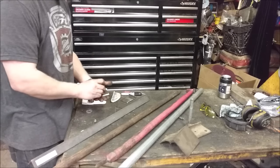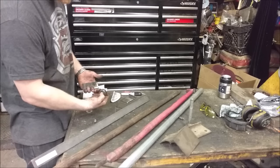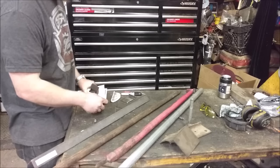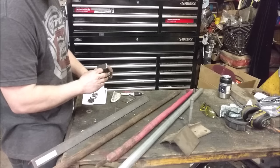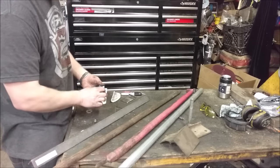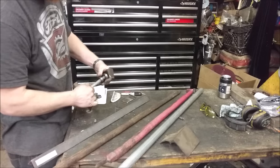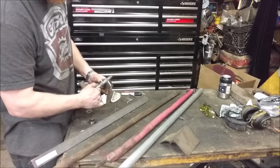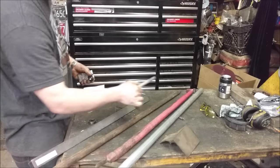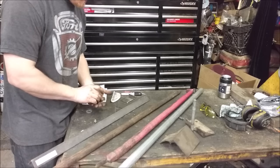I'm going to use these bearings. These are 99502s. They're very, very common for front axles, for lawn tractors and stuff like that and go-karts. Usually they have a little C-clip channel on them that you can just pop out the C-clip. But they're cheap and they're abundant. They come with a 5/8-inch hole. So a 5/8-inch bolt with a shoulder — they're snug. And that's what we're going to use to mount these. So I'm going to stack two so that will get me tall enough.